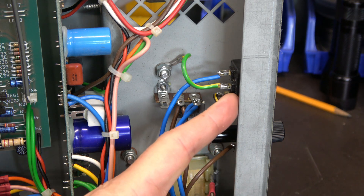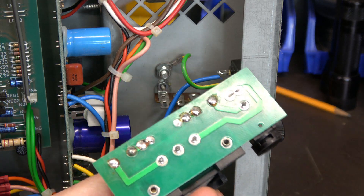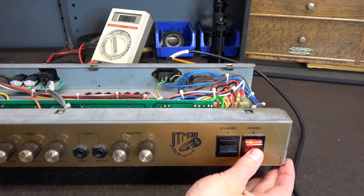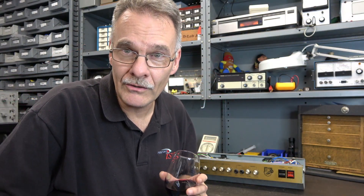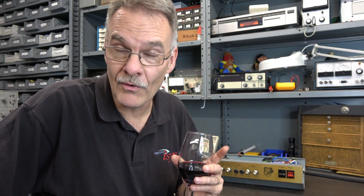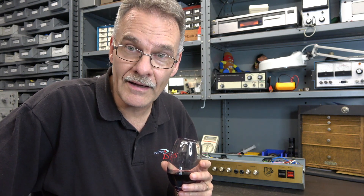There's a completed job — we've got a new AC socket, fuse holder, terminal board for the cap, and this original circuit board assembly will never have to be installed in this amp again. In the moment of truth, she's all wired up — does it power on? Yes, it does. So we're good to go. I still have some other maintenance items to do, but I just wanted to show you guys this portion of the repair in case you run into one of these amps with a busted AC input jack on the back. Now you have an option. There you have a free tech tip from D-Lab Electronics — you always don't have to use stock components to fix your amps. In this case, I consider this an upgrade to that Marshall. If you want to check out more of my projects, take a look at my website at DLabElectronics.com. Thanks for tuning in.